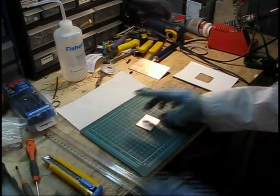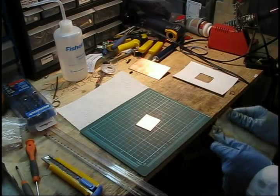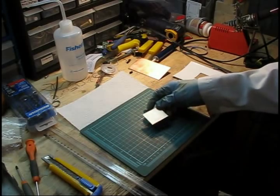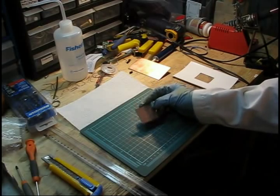Once you've done that, one of the key steps you want to do is surface prep. If you do not prepare your printed circuit board material or copper clad properly, any fingerprints, surface oxidation, dust, sharpie marker, or pretty much anything other than copper will not etch.